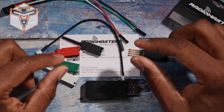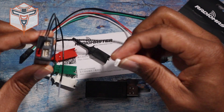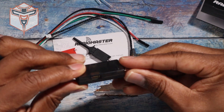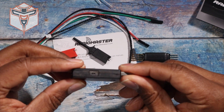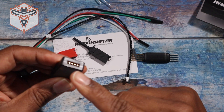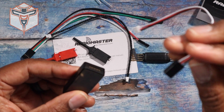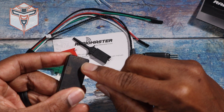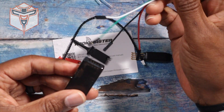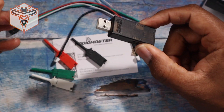This is just fantastic. I have my ExpressLRS ER6 that I'm going to be flashing. The cable plugs in here, and the dongle has its cable on this side — you just plug it in. If you need to, you can select the voltage: 3.3 or 5 volts on that side to provide power. You also have your connection on this other side. This is basically CRSF, so you have your negative, positive, RX, and TX connections here. You can use this to connect to it, or create additional cables to connect and be able to configure and flash your receiver.